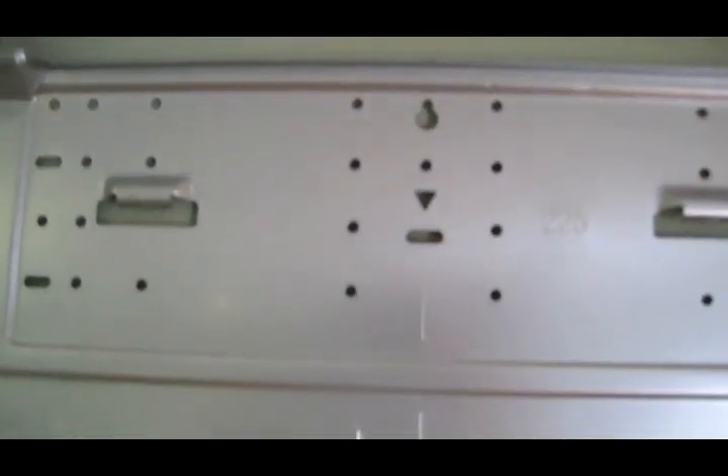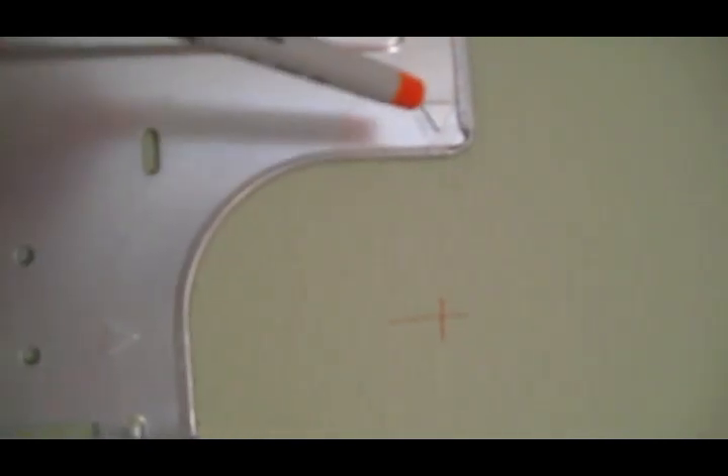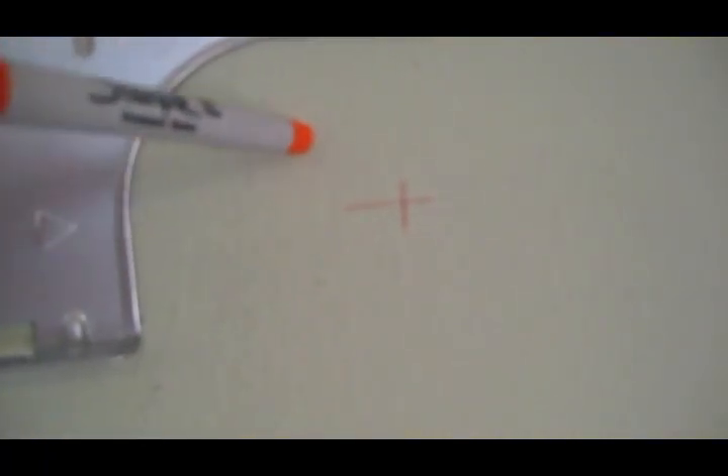I've put those markings on the wall — you can see them coming out right there, also a vertical mark lined up right behind here. I took some short finishing nails and hung it up, pretty close to the right place. The marks over here point to the center spot where the three-inch hole needs to be cut to pass the tubing, drain, and electrical wire through. Our challenge is how close those studs are behind the wall — we might have to shift everything over a little bit.